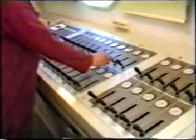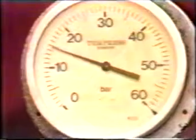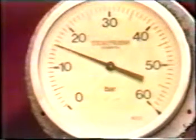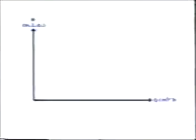4. Follow the same procedure for cargo pump number 2, 3, 4 and onwards. Be sure that enough hydraulic oil is available for the cargo pumps. If not, the cargo pump speed will drop and capacity head will be reduced. 5. The shoreline back pressure will increase when more cargo is pumped through the line. To clarify the above, we have to look at the performance curve for the cargo pumps.